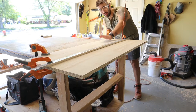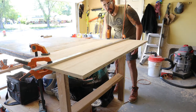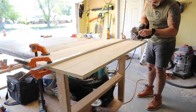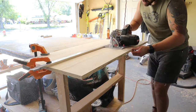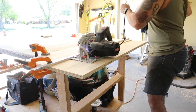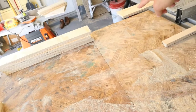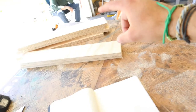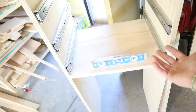I'm cutting my top storage shelf — this is 12 inches deep — so I can use the excess material as my drawer boxes for our three drawers. What I did is use the table saw and ripped off two piles of four-inch tall pieces and one pile of three-and-a-half-inch pieces, because we're going to have a four-inch drawer, a four-inch drawer, and a three-and-a-half-inch drawer. The bottom piece will also be three-quarter-inch, so all drawers will be right around five inches with the exception of the top one. I'm going to get these cut to size and assembled.